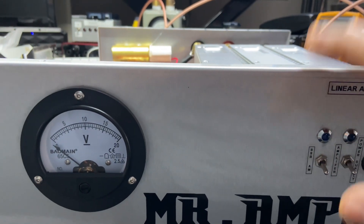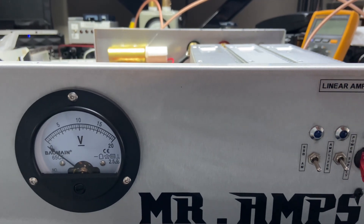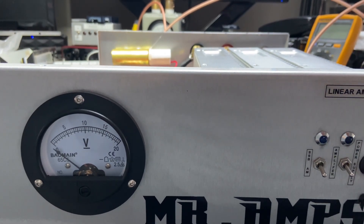The reason I did that is because this amplifier is Class AB, meaning the amplifier will run hotter. So you want to keep all the components as low in temperature as possible.